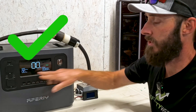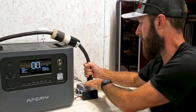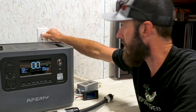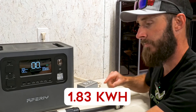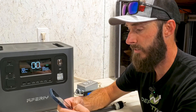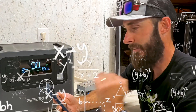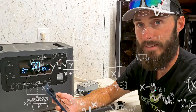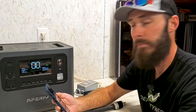The test is finished — we're down to 0%, nothing coming in or out. After reconnecting to the monitor, we got 1.83 kilowatt-hours. Taking 1830 divided by 2048 gives us 89.3%. That's lower than 90%, which is kind of the bar. I'm not crazy excited about that — I'd like to see it higher, like 93 or 94%. So definitely not the best performance on battery capacity.